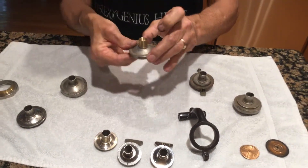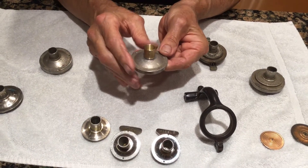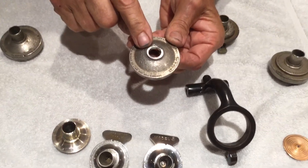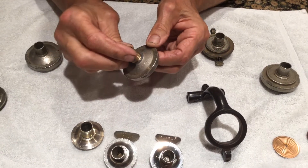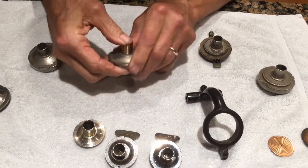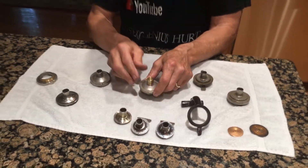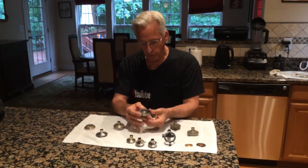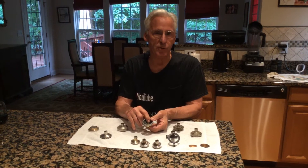So on this one, everything was there for the Reproducer, but they had broken the top off. So what I did was I machined a new top out of brass, because these Reproducers here, the C and H, are in brass and nickel-plated. And then I will come around and I will superglue this in place, and then I will pin this.